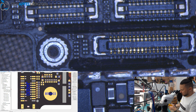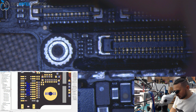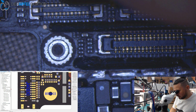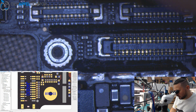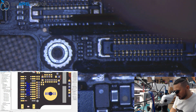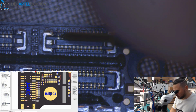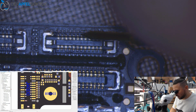and just have a look if the connector readings are matching. I already did that, and they are all matching completely in my case. So I can be sure that the readings are okay and all the diode mode values are correct. After that I already took the voltages, and the voltages are there too. Same for the front camera.